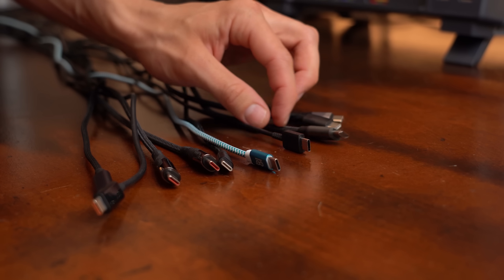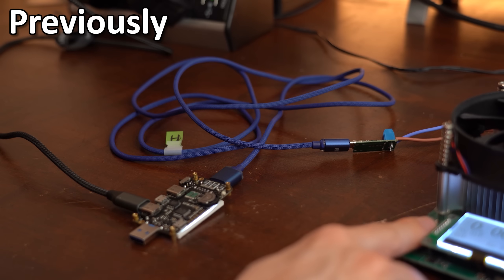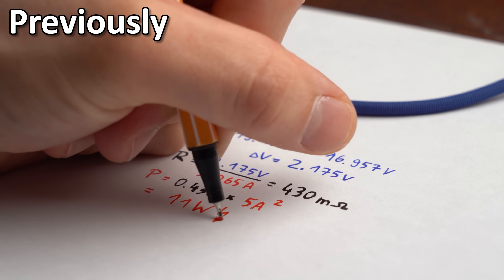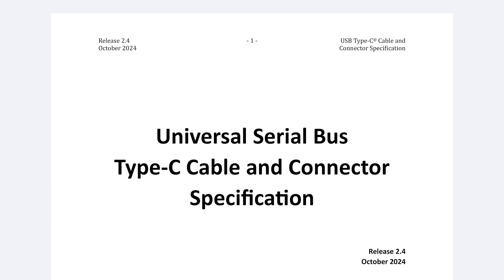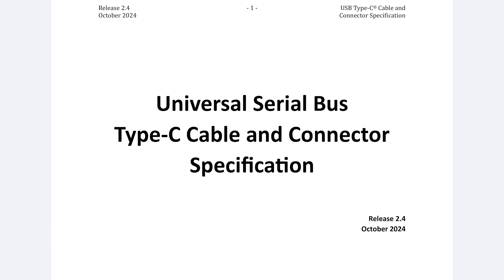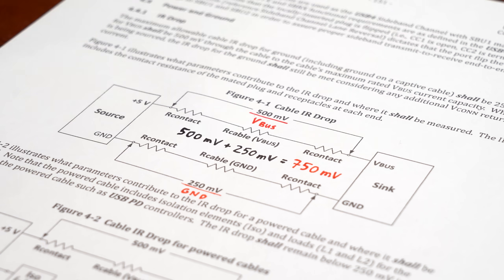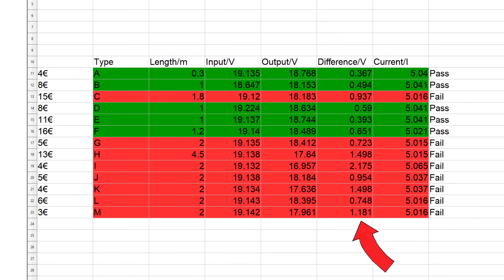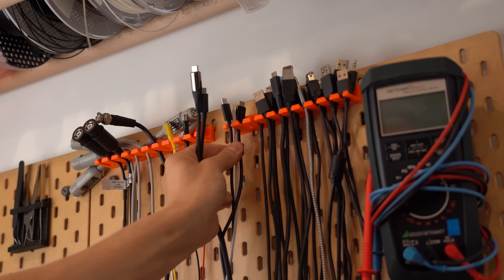To give you a bit of context on how bad USB-C cables can be: two years ago I did a dedicated video where I tested 13 cables. The worst performing one featured a power loss of 11W while 100W were being drawn — which is enough to slowly charge up a smartphone. What shocked me more was that according to the official USB specifications, your complete USB-C cable should feature a voltage drop of less than 750mV, and according to my tests only 5 of the 13 cables did that. But maybe times have changed and all the new USB-C cables in my lab will fulfill this criteria.